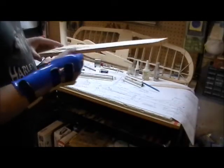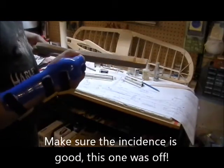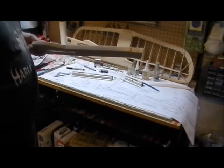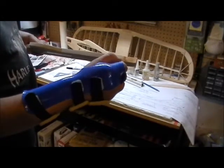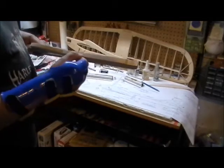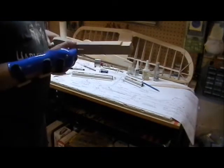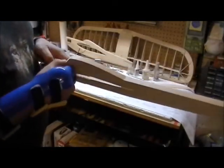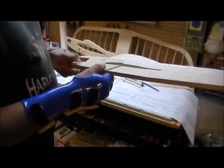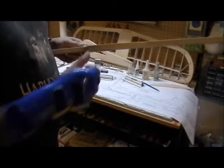On the top, make sure you don't round off where your stabilizer's going. With your vertical fin, you want to leave a little flat spot there. You'll be putting your dorsal fin on, and it probably starts around here — so you might want to measure and mark that up before you round things too much. You don't want to be trying to glue your dorsal fin and vertical fin to a rounded fuselage top. I'm finishing off this little bit of sanding on the plywood doublers, and I'll start rounding things up.